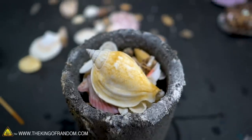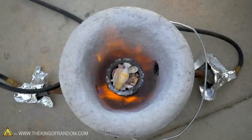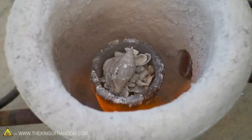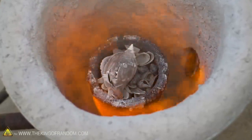Let's pop the shells in the foundry and turn up the heat. We had those shells up to a point where they're glowing orange — it's hard to tell because it's daylight out, but with the lid on we could see the glow through the holes drilled in the lid. Hopefully they've chemically changed. Now we just need to let them cool down and do some tests to see if we've got lime.